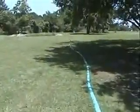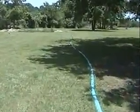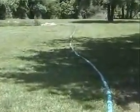In addition to the 75 feet of non-collapsible hose, we have 3 50-foot rolls of lay flat hose going up to our spoils area here. So we have a total of 225 feet of discharge on the unit right now.